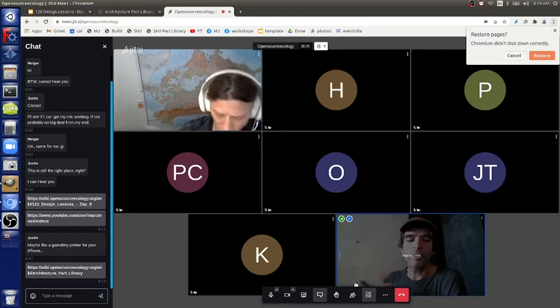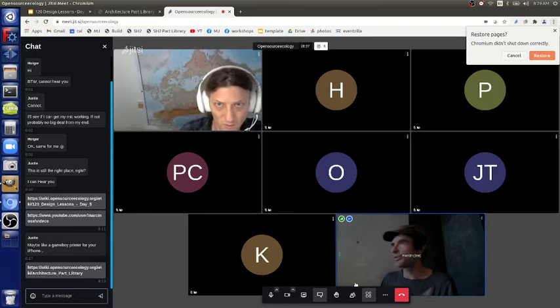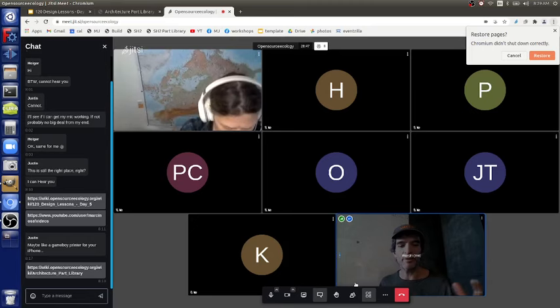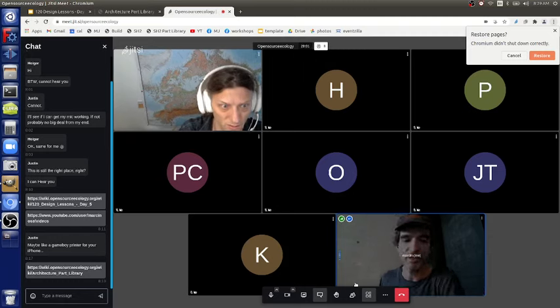you can start one CAD document that's maybe like a placeholder, into which, say, you draw a foundation in one document, because this is a real workflow, we start with a foundation, great. So how do you fit all the walls on it in a large workflow? You can say, in our system here, we've divided the walls into modules 1 through 23 on the first floor. If we divide these specific modules among everybody, and you know which wall it falls on, you can take, for example, the foundation drawing, and say, oh, okay, I need to put that there. And that's our reference point.